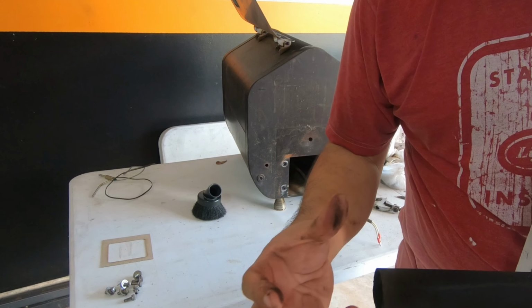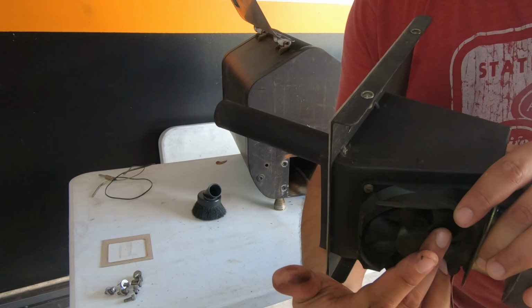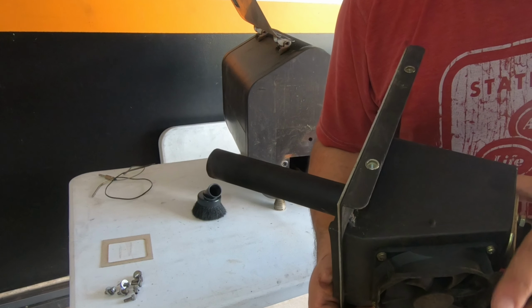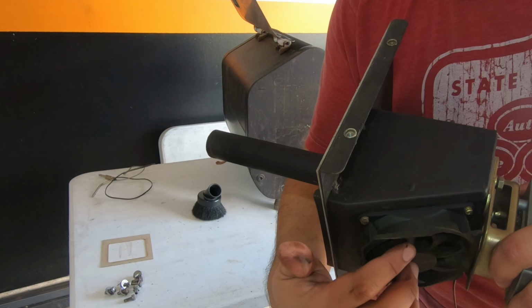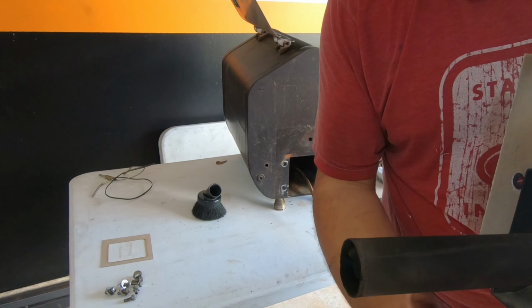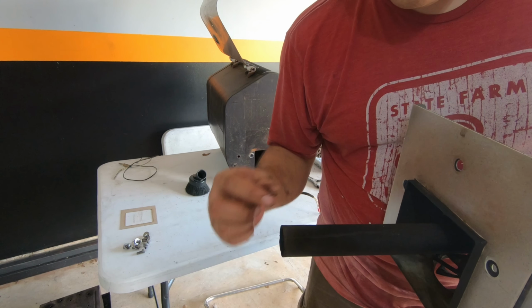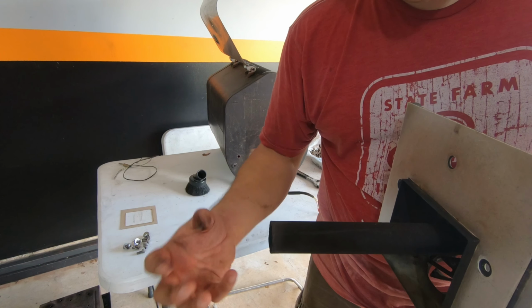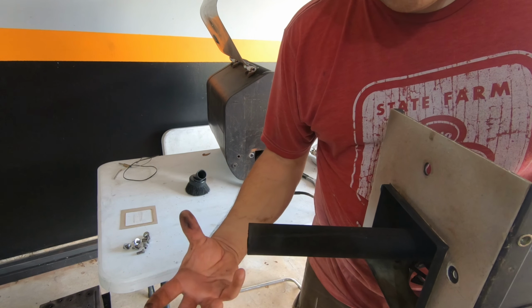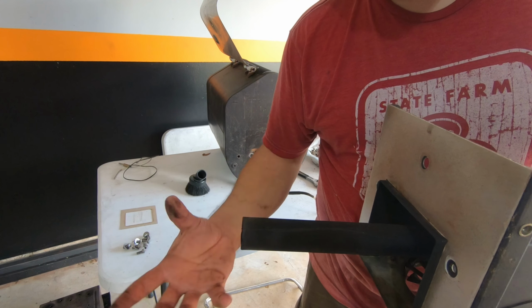And then when you want to smoke, the auger slows down and the fan underneath also slows down. With any fire, if you feed it with oxygen or air, it'll burn hotter. So this little fan will spin real slow, just slowly puffing away, pushing air up into this little box area that then feeds the firebox. When the pellets start to ignite more, the computer knows to drop more pellets, so it creates a bigger fire. When you want more heat, the fan is blowing full blast. If you're going 550 degrees, it's going full blast, dumping pellets in, constantly building that fire.